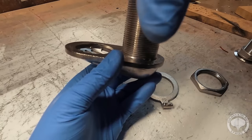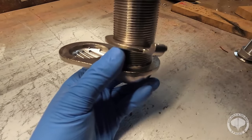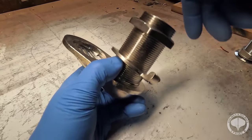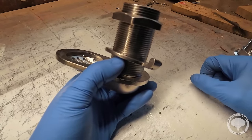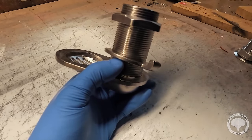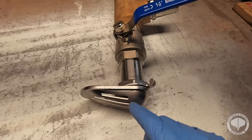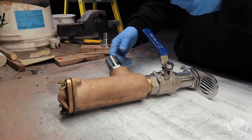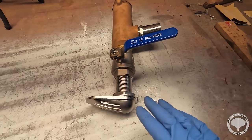The block has to have a good radius around it because the on-off valve and strainer go back on, and there's a lot of weight. You have to reinforce that weight by putting a packing block on the other side of the hull. So this is a sea cock in its entirety — all the parts for it. It is a big one for such a small vessel, but there's a reason for that which will be coming up in a later vlog.